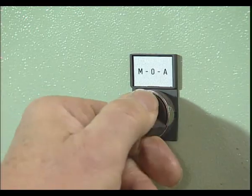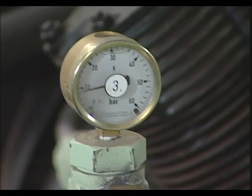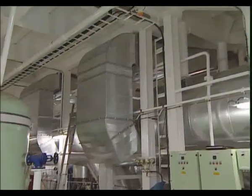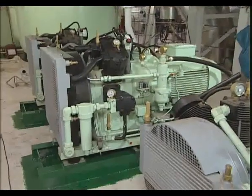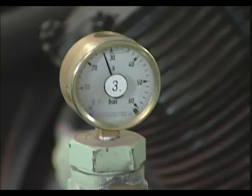When the compressor starts in manual start-stop mode, the correct adjustment is for the drain valves to close after approximately 15 seconds and the compressor to come onto load. Every 15 minutes for about 15 seconds, an automatic signal will open the drain valves to dewater the compressor. The proper function for this cycle can be seen as the air pressure falls on all stage pressure gauges.